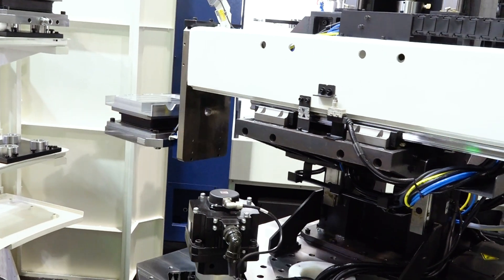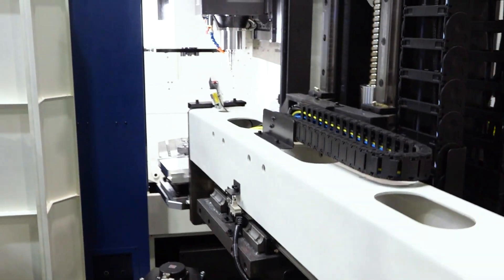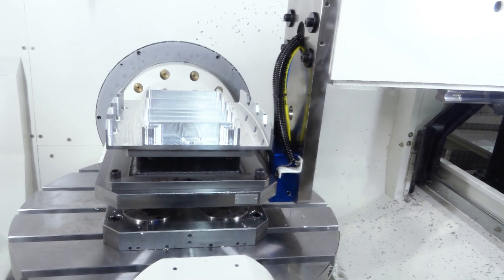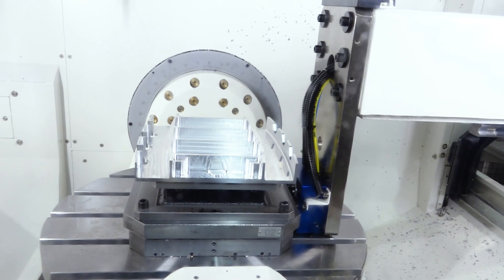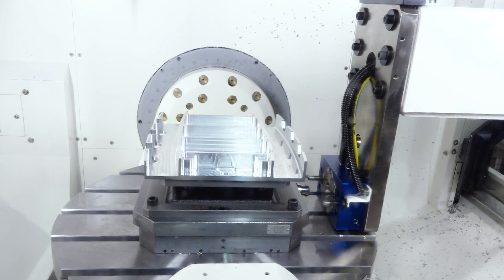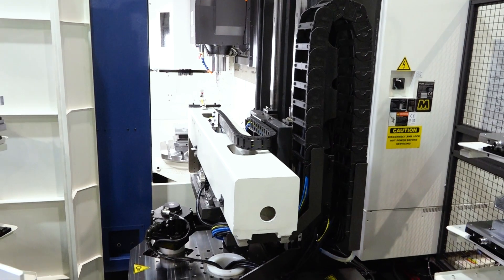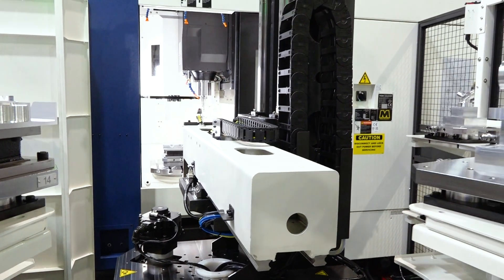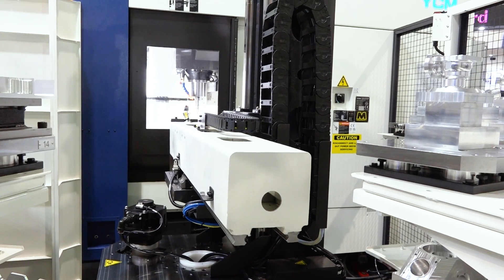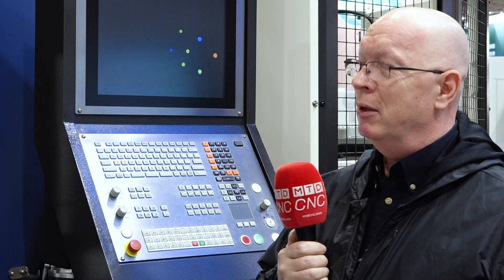You basically said everything that needed to be said. Almost 99.9% of all customers I talk to today say, if you had a guy that could set this machine up, I would be happy to buy it, only because it can run by itself after that. And that's basically what this machine can do. If you've got two different levels of seven and seven, you can put 14 different parts on it and let the machine run 14 different parts at a time. All you have to do is change out the pallet and put a different one on with the next part. This machine allows you to do a done-in-one scenario, truly.